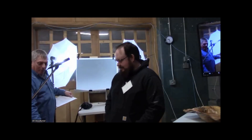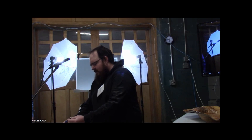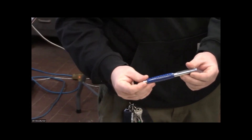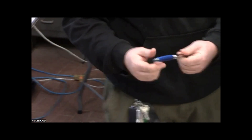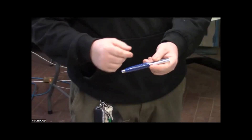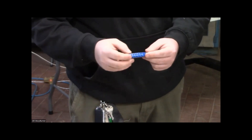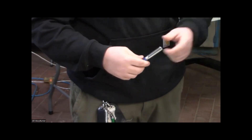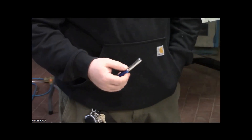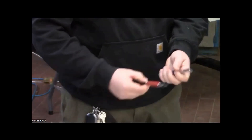What kind of blanks are these? It's an aluminum honeycomb — basically a furnace filter with epoxy poured in. They're fun to turn because you have to use sandpaper to knock the edges off first. If you try to turn it directly, it'll hit the little cubes and pop the whole thing out of the aluminum. You basically use sandpaper to get it mostly round, then a negative rake cutter to actually turn it — otherwise you'll start popping them apart. I showed my dad how to do it and we had two of them blow up on the lathe the first time.